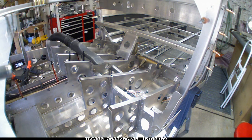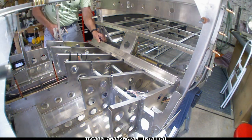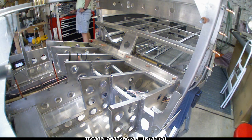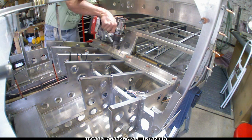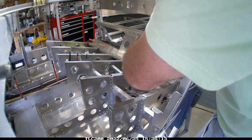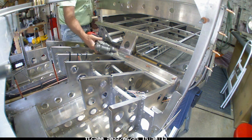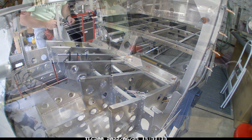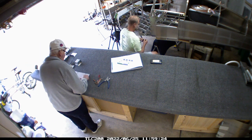The one thing that I thought was interesting was that vertical piece there with the big hole in the center of it — the lightning hole — has a flange on it going all the way down. With the flange in place, it really interfered with the rudder cables. There's a black sleeve on the rudder cables so it wasn't rubbing, but it caused the cable to have to bend out and around that piece. It just didn't look right, and the piece is installed correctly. So I just carved out a little bit of that to allow for a straight line.